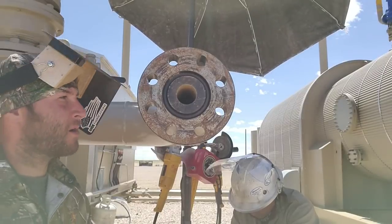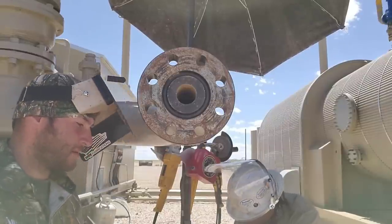Kind of hard to see, but I'm gonna do my best to show you guys. See, that's just slag. It's just piled up in there. We'll show you guys once I knock it off. So there it is on the inside. That's the bead stacked up in there. Now I can't drag it downhill. I gotta go uphill with this. It's really hard to focus in on you guys, but you can see the bead in there, stacked up real good. Still a little bit of slag on it. Now we're attempting to go up from the opposite side.